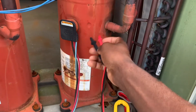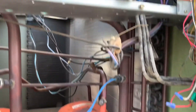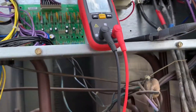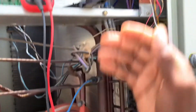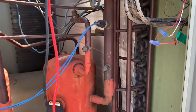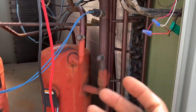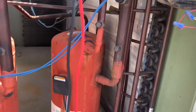If you push the contactor and the compressor doesn't run — if it hums — it's going to be pulling high amps. You can use a clamp meter right here to verify. Once it passed electrical testing and you have power going to it and you push the contactor, if it hums but doesn't turn over and run, then it's a bad compressor — a mechanical fault, the internals are seized.